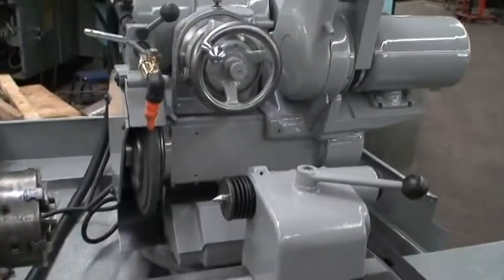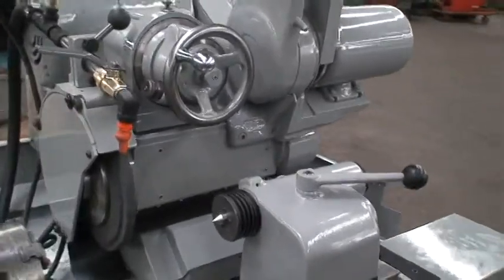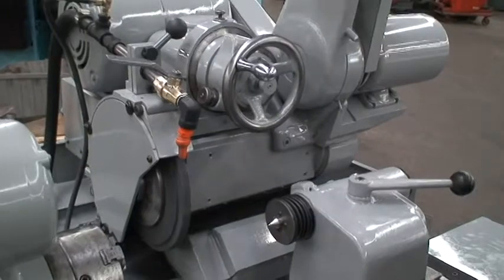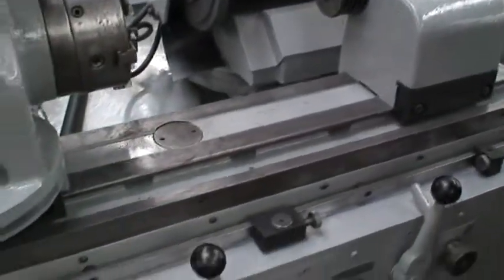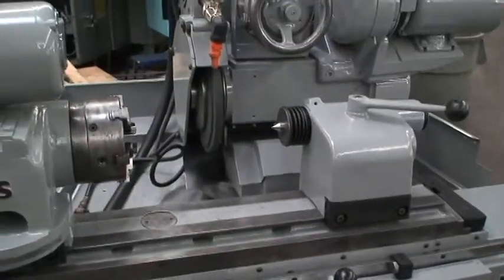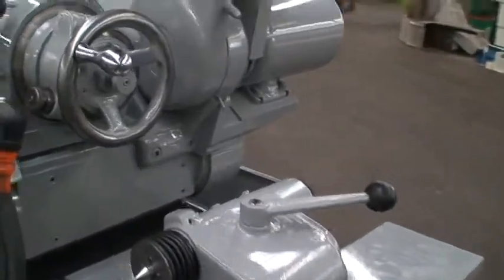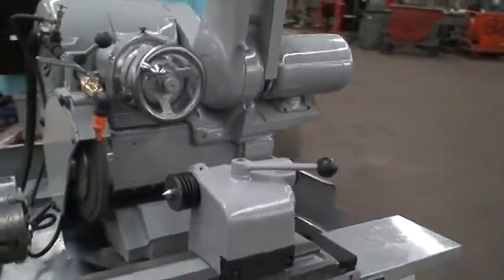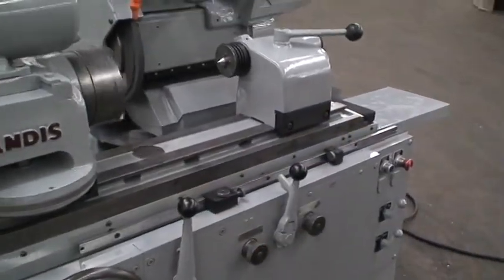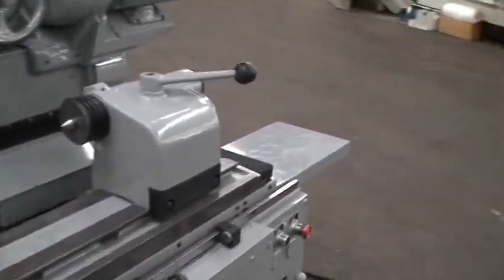So that's the hydraulic motor now. I'm going to start the grinding wheel. Very quiet, nice smooth machine. We did clean and paint the machine and re-scrape the longitudinal table ways. It's just a nice smooth machine now.